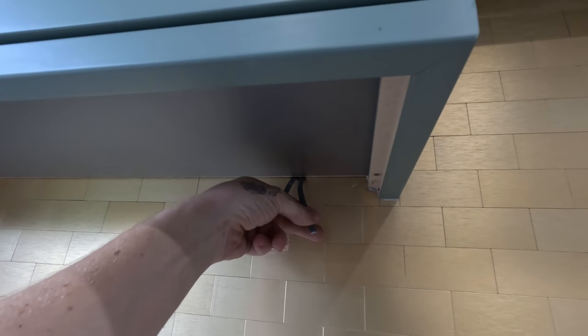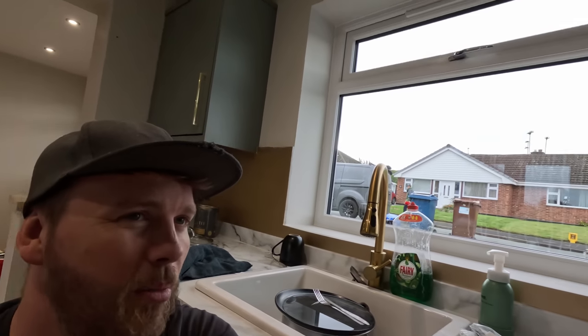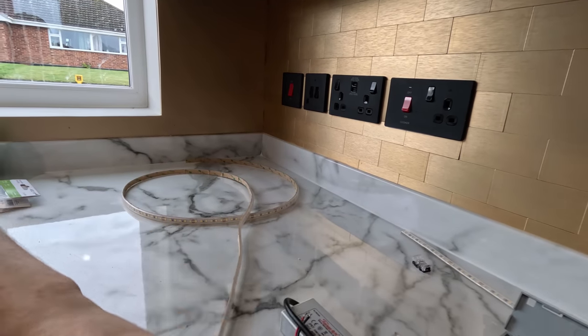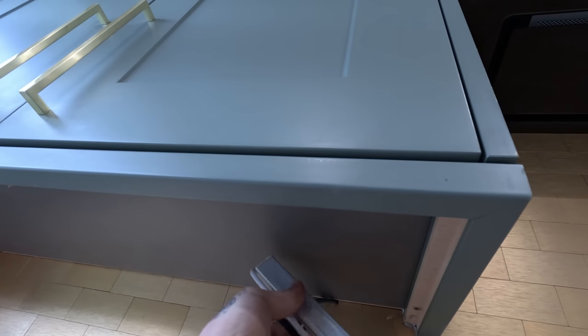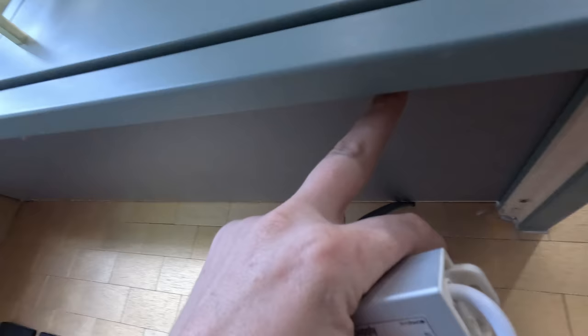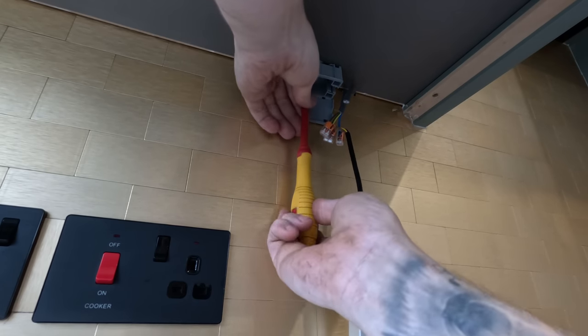Same thing here like I said in the last video - that is the feed that goes over to that one but the builder left it in the ceiling. He forgot to bring it down and we couldn't get to it now because it's the finished ceiling, so there's a microwave going under there so it won't be too bad. I'm going to do the same thing - connect up the LED tape, get it into the driver, link that up, double-check it's all working, and then mount it up. I could probably put the driver sideways and allow me to start the LED tape within the corner and around.